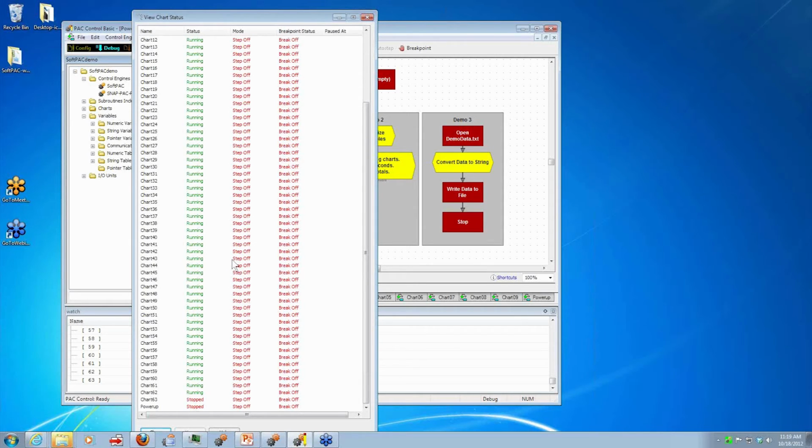Because we're running under Windows and we're limited to their Windows TCP/IP stack, and again, this might be a little more than you wanted to know in terms of detail, but on the hardware-based PACs, we have an RTOS, which is a real-time operating system, and the TCP/IP stack that we had on there, which we have the source code for and control over, was optimized in particular for that RTOS. So if you're wondering about the differences in I/O access, you're not going to see that big of a difference. Yeah, notice the green I mentioned before down here. So anyway, running and happy.